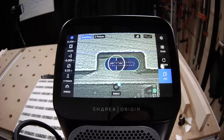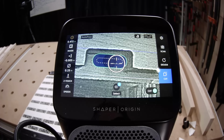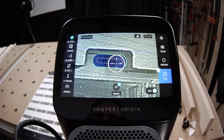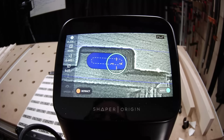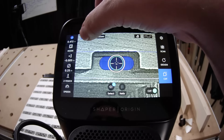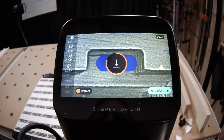Cool. So Jake's using offsets. He's going to go ahead and just kind of touch up the dimensions on each one of these. Now, we used offsets earlier, remember, for the roughing pass and the finishing pass on our fixture parts, glue up fixture, and hinge mortising fixture. The positive offset left a little bit more material around the entire perimeter of that fixture part, and then the finishing pass at a zero offset took off that extra material and left us with a perfect line-on-line fixture part.